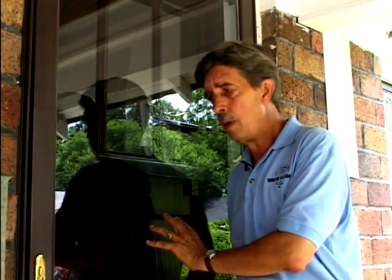But all these advantages can be outweighed if in the summertime we get some solar heating on this door. If we have any sort of full sun or partial sun on an exterior door like this with the storm door, this space between the two doors can become like a solar oven. And that's not only going to ruin the interior door, it also is going to raise your utility bills.